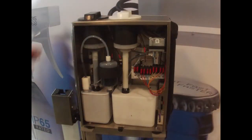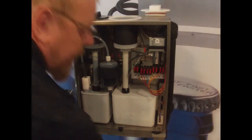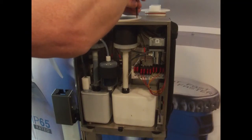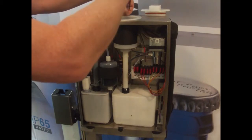Okay, so coming back to the printer, we need to take out this smart fill, the makeup smart fill cup. So I'm going to take the cap off, grab my Phillips bladed screwdriver, and we have three screws as before in other tutorials. We take those out, careful not to drop or lose them. They are very small.